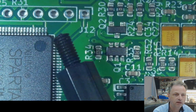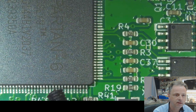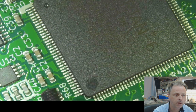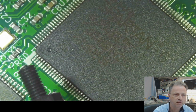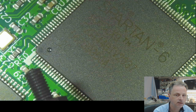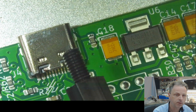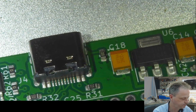I did solder the tile in there. Looks very pretty, I think. Did that by hand, combined with reflow in my vapor phase. I have some video on that. I might show that later. Could be interesting for people just playing along at home.